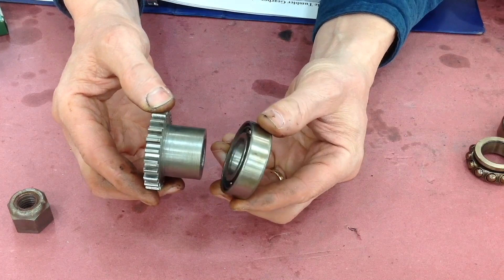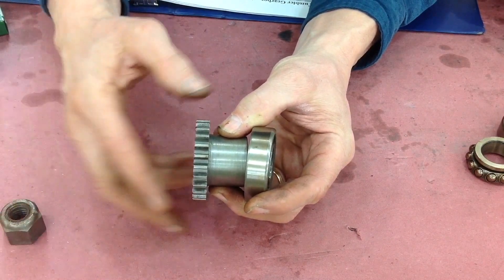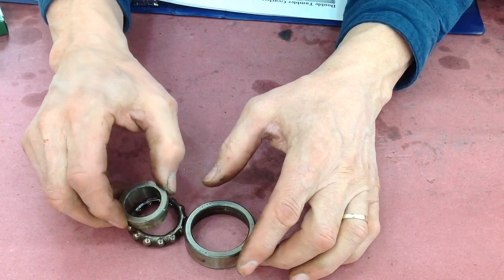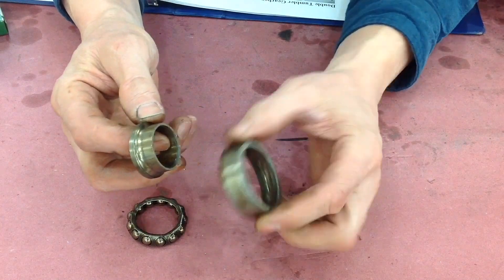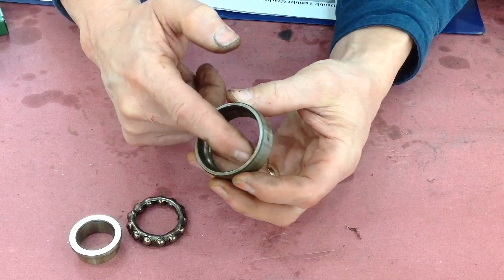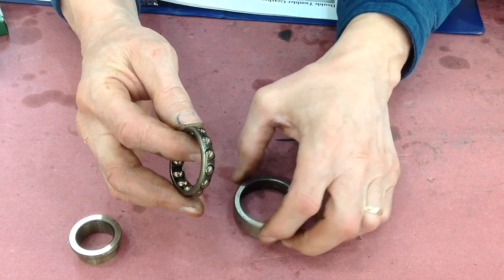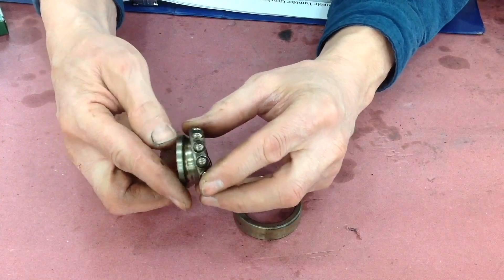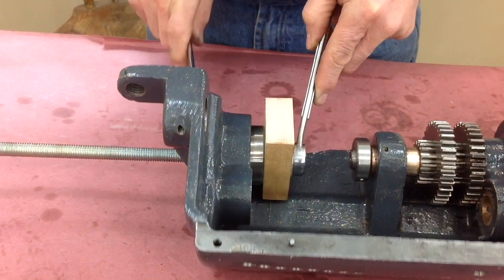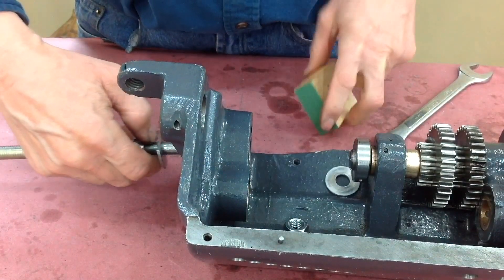The thrust bearing is installed on the lead screw, and this is the lead screw gear which is attached by this lock nut. The thrust bearing is designed to counteract a lot of the pressure that's going to be on that lead screw. This is the old bearing that came out of the machine — it is an angular contact bearing and you can see the inner race and outer race have that angular portion on them. The ball bearings fit against that race in an angular fashion to counteract the thrust of the lead screw. I use the half-inch threaded rod to press that bearing into the casting.